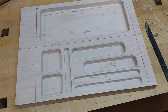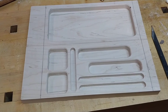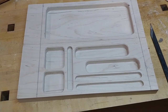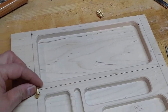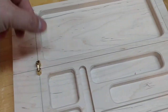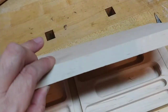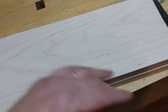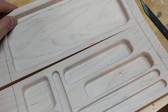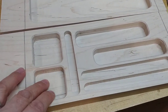Today we're going to install some barrel hinges. This is a D&D, or Dungeons and Dragons, dice vault that I'm making. You'll see these are the barrel hinges — they're going to go right here just like this. This top here is actually the dice tray, so that's going to fold over. I've already milled this all out from a solid piece of hard maple, and you can see the cutouts I've already milled.